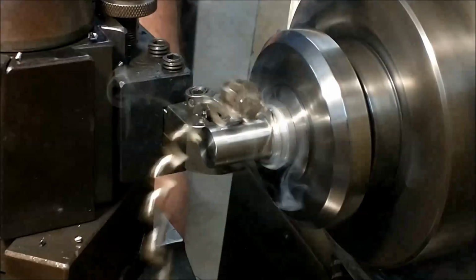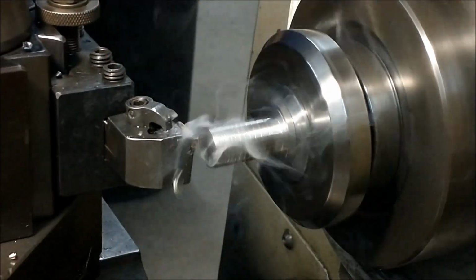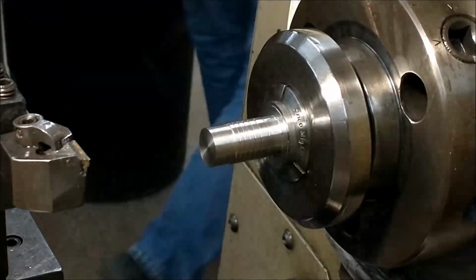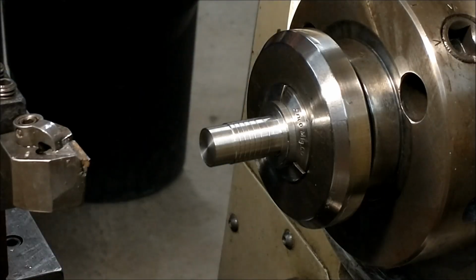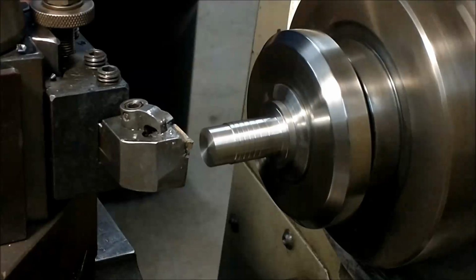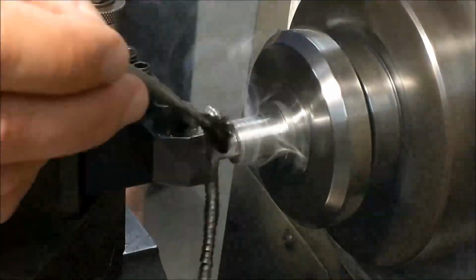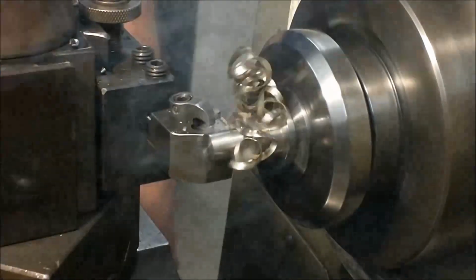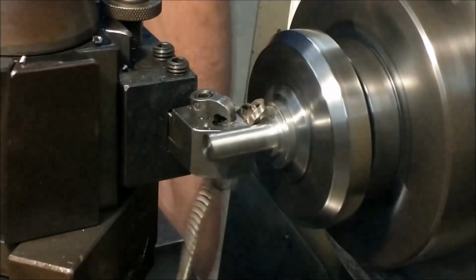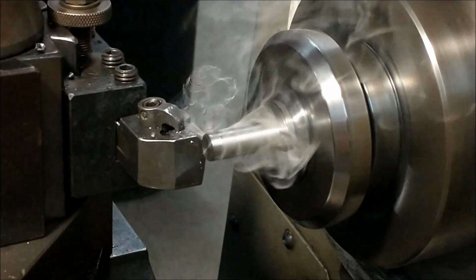That is a visual indicator if the material starts to migrate into the collet. As you hit the number for each pass, you will notice that the material has moved into the collet. If you have that issue, dust a couple thousandths off the face of the part and continue the part. Make sure that if you are going to measure any part that has a critical diameter, after this much amount of material being removed, that the material is cool. So check it, but don't burn yourself.